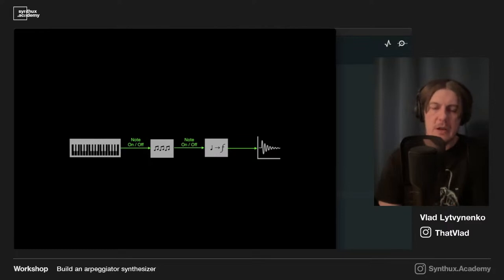And in this particular project, I used a lot of concepts from MIDI. So when we press a note, it's not really a press, it's just a turn of a knob. Yeah, it sends note on and it sends note off when it should stop. So the concept of this MIDI protocol is implemented here, and also what we send is note number and velocity, like what you have if you do MIDI.